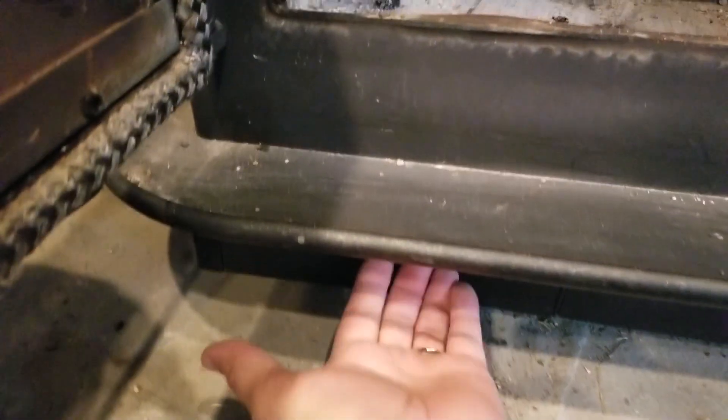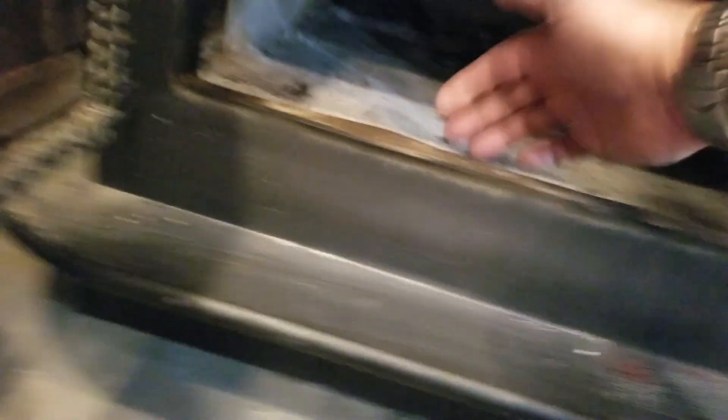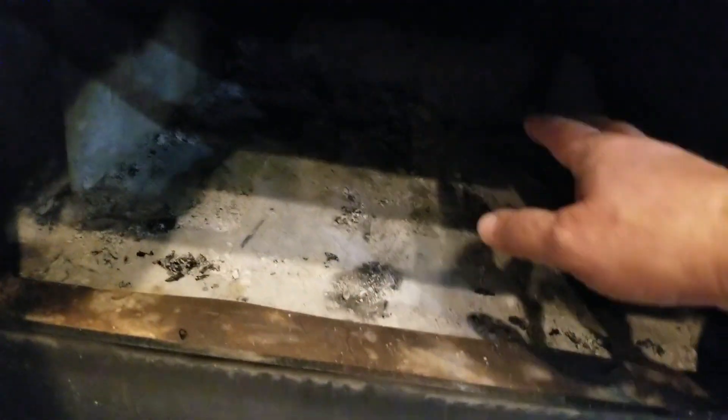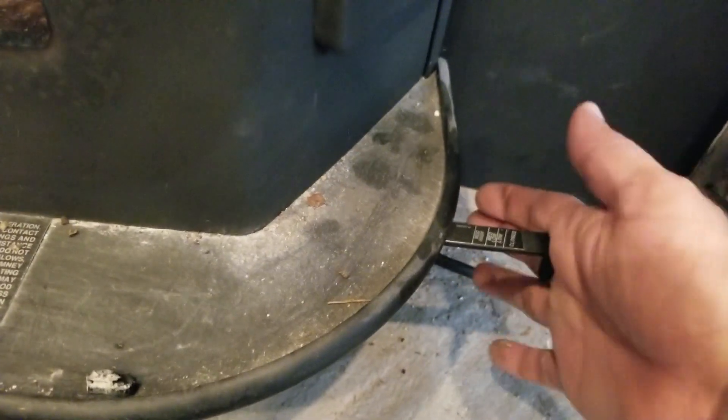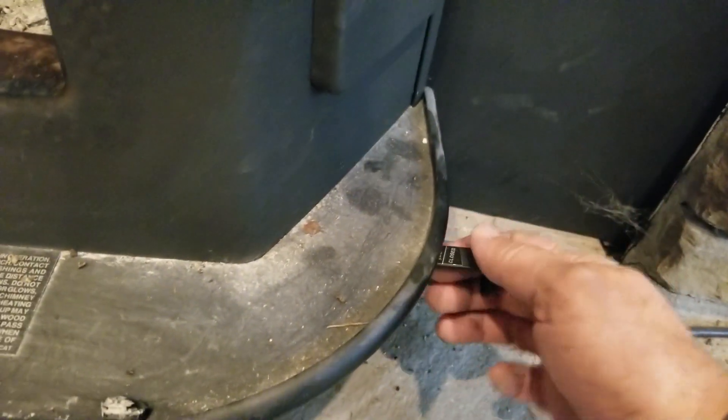You'll also want a vacuum cleaner — it's really important. When you look at this wood stove, the air comes up from underneath and flows from one area out to the other. As you're running a fire, ash can fall down and block your airflow. This is basically the simplest stove there is. There's a throttle on this end — wide open gives you maximum airflow. When you close it, it's logarithmically changing the amount of airflow.